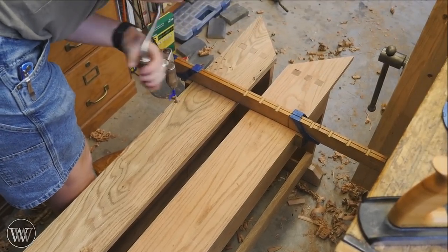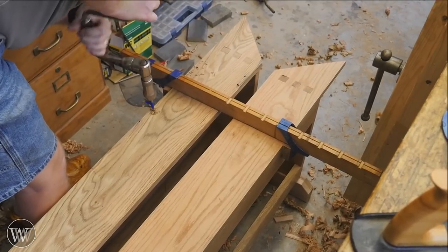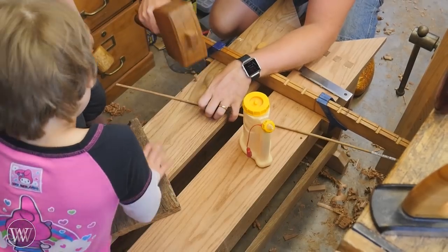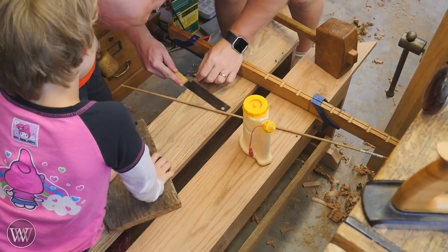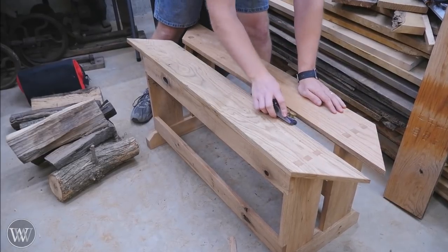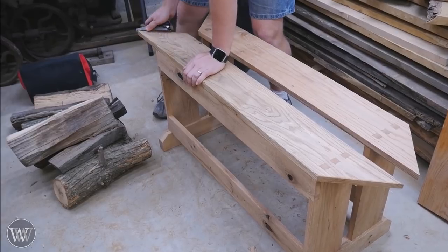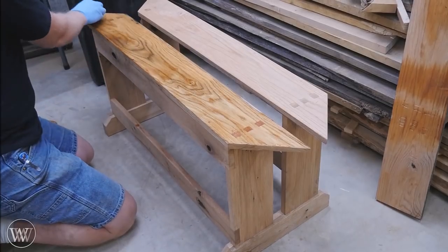I also want to connect these tops to the stretcher, so I'm going to be boring out some holes — just a quarter-inch hole that will go through the top and about an inch or so into the stretcher. After boring it out, I can drive in a quarter-inch dowel with some glue and then use a flush-cut saw to clean it off and cut it flush, as the name implies. I kind of like doing dowel joints — they're simple, they're easy, and just anyone can do it. The last thing before finish is cleaning it all up — I'm going to use a block plane to put a fairly heavy chamfer on all the corners to make it feel good in the hand, as well as using a regular plane to clean up any of the tenons or posts that will be sticking through and give it nice smooth edges.